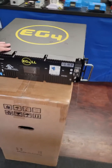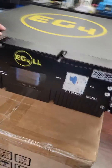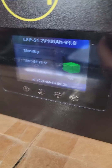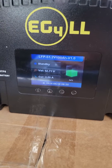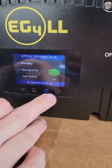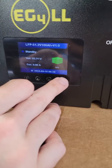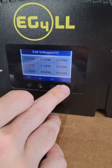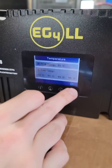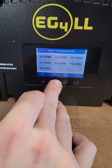Looking pretty good on first impressions. Let's see if we can power it on. It's giving us its status right now — 52.71 volts, which sounds about right. It is in standby and current is zero. Looking further, that looks like cell pack voltages and we've got temperatures too — not stuff you'll need on a daily basis, but it's good to have.